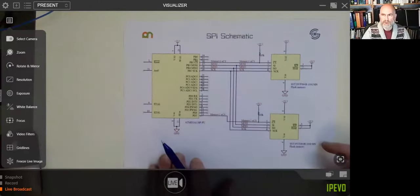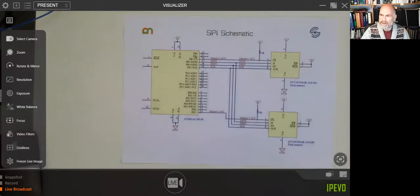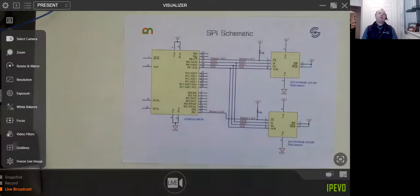What voltages are they? Are these always 3.3 or some of them 5 or what? Good question. 3.3, 5 volts. When you select your device, make sure that you do check. Most devices I've noticed these days tend to be certainly 3.3 volts. Some I've come across are lower, like 1.2 volts or 1.8 volts, but there's no real need to start using those because you'll find what you want in a 3V3. I would stick with 3V3, or 3V3 to 5 volts for that particular chip.